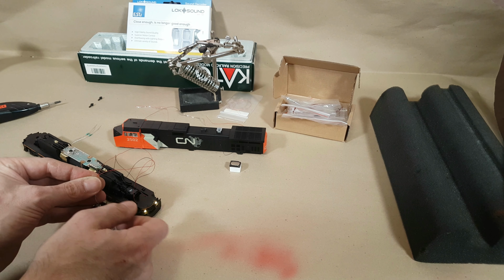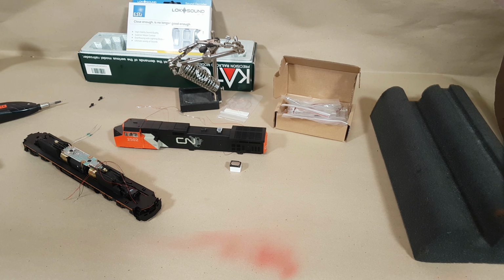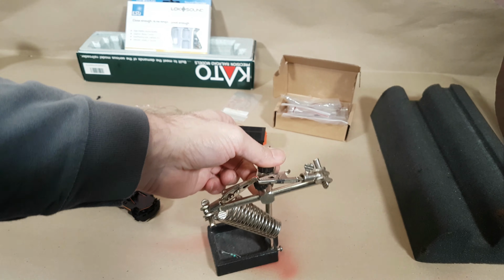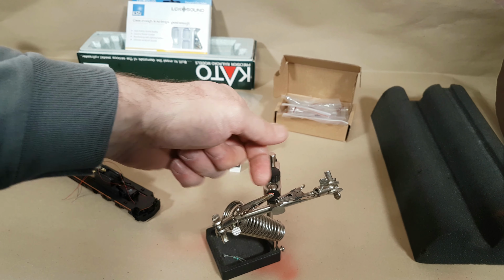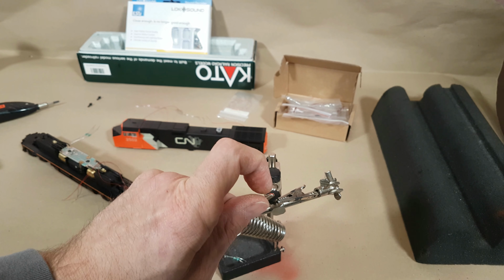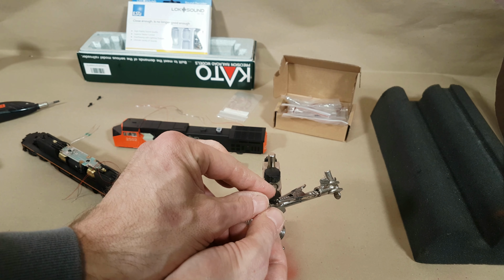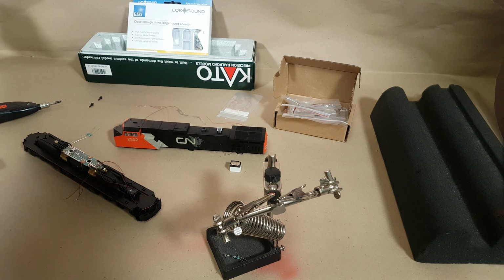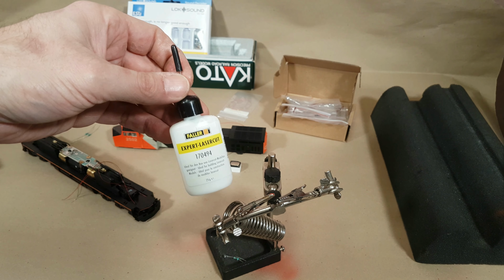Right, and off. So that was part of the challenge, over and done with. Yeah, and again, because my eyesight's not quite there, I actually use this. So I clip basically the light tube, or in that case, just the little snippet there. Put the LED in there, sort of line them up together so that the LED is basically touching the top and facing the right way. I go in there with this stuff. I like it, the Faller laser glue.